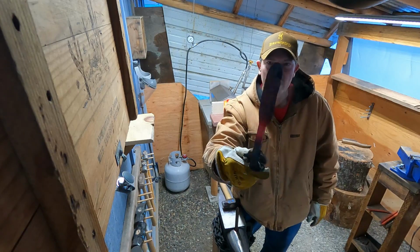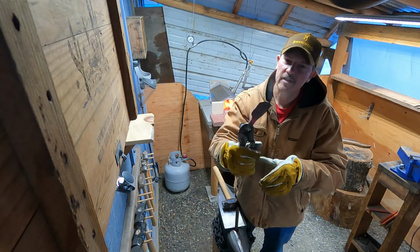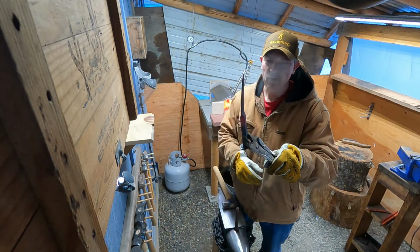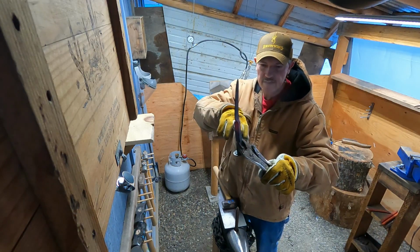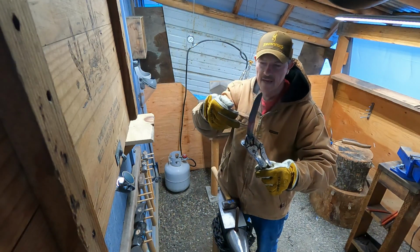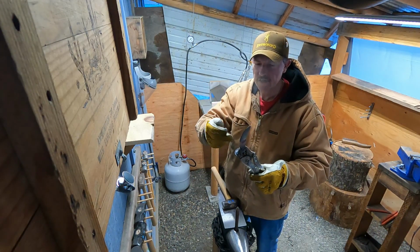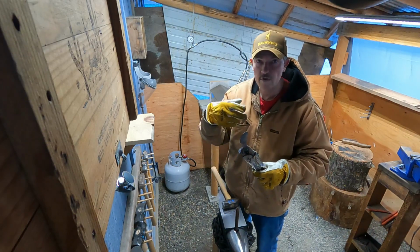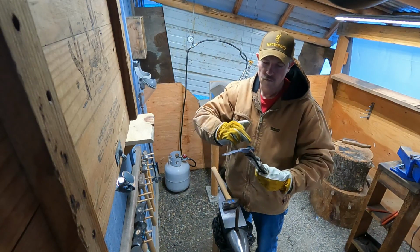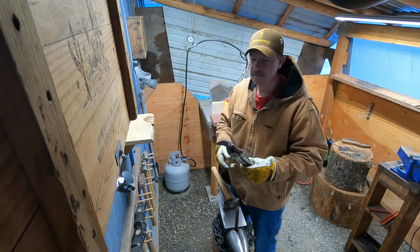Right now, it's kind of looking like a butter knife, but we'll get that all shaped down, getting close, getting a little taper put into it, and just working it down. So I should be able to put a twist into this pretty soon, but I just wanted to show you guys that I stretch the handle, work the knife, then I come back and twist the handle, just so that I can still grab it. If I put a twist in first, there's a chance I'll mar it up on the anvil or with the hammer, and then you can't really fix that. So at least this way I can reshape the handle a little bit, square it back up if anything happens, before I put the twist in.